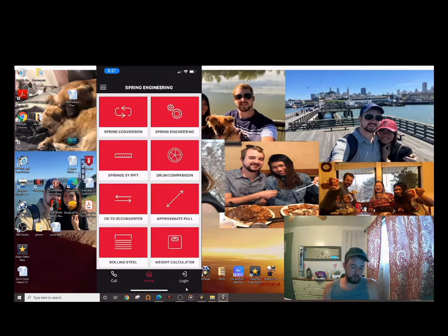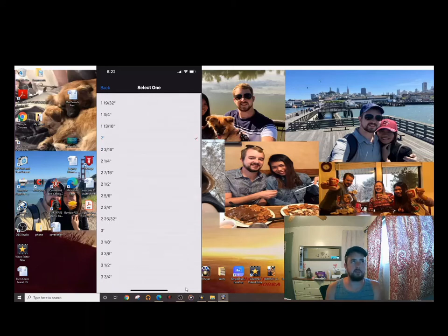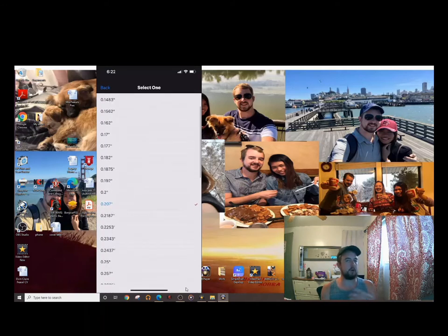Go to Spring Conversion — that's top left. This is where you enter everything. Pick your inner diameter — typically only two-inch or one and three-quarter inch for residential. Then pick your spring size. If you're unsure, this lists all the generic spring sizes, so if your tape measure math came to something like 216, the app shows the sizes in that range — 207, 218, 225 — and it rounds to the nearest one, which would be 218. That means you were just two one-thousandths of an inch off. It really does matter that specifically.